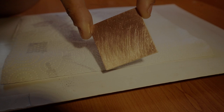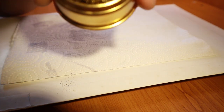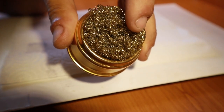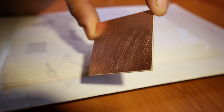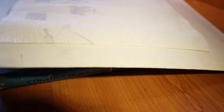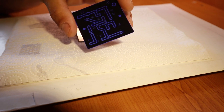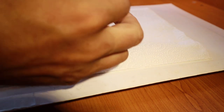I've cut a piece of PCB to the size I need and cleaned it up with a brush — the kind used to wash pots and pans in the kitchen, a steel scrubber — using a lot of soap and hot water. I clean the PCB very well. This particular one might not come out perfect because it has the little dots I punched with the needle for the other kind of board, but we'll see.